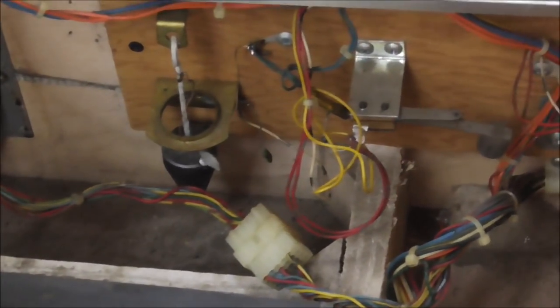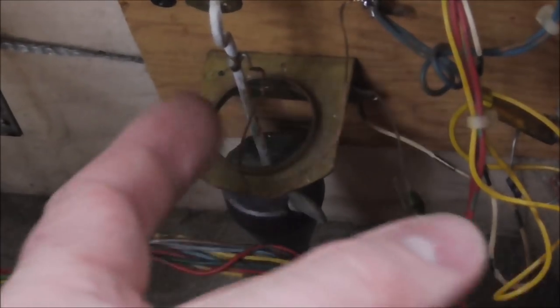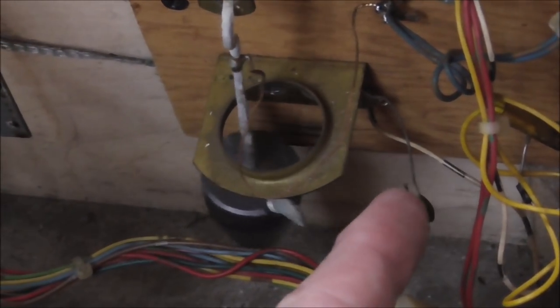Okay, folks, I found it. I had seen it before, and I even checked it earlier, but it did not behave as I thought. So this is what you look for. It was the damn cap. Should have known. There is a little cap on the tilt bob. I've disconnected it now, right? It goes across the strobe and the return on the switch. So whenever this tilts, if it just barely touches it, the cap makes the pulse wider so that the game sees it. You have the same thing on pop bumpers a lot of times.